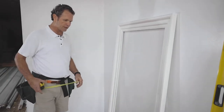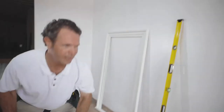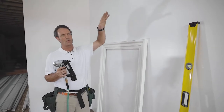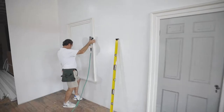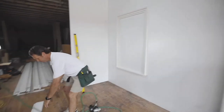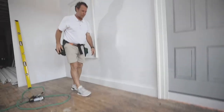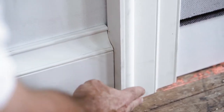For the window, a two-to-one proportion is good — this one is 31 by 62 inches, so two to one. The pedestal height here is about 25 inches; I typically tell people pedestals that get too low don't work well. I recommend between 28 and 32 inches. I've measured 28 here and 32 there — I'm going to set it at about 32, comparing the heights of the window versus the door. Now we put our base molding — this is the Windsor base — and it dies in nicely behind, leaving a great shadow line.